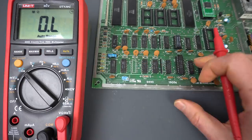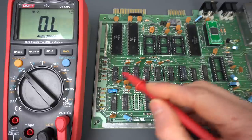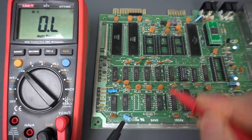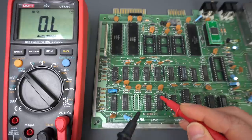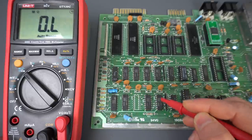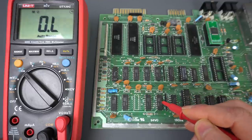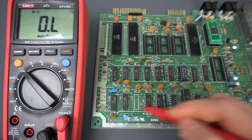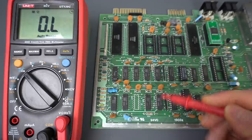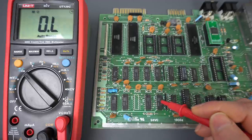I don't know exactly what's going on. I don't know if we pulled out the one weird one and all the other ones are busted. But the RAM is pretty likely that it's bad. So what I'm going to do is remove one other one — in particular this one, because I remember this was one of the data lines that was mostly high, whereas the other ones were mostly low. That way, that will let me know if that was coming from the RAM IC or from somewhere else. And then most likely we'll go ahead and remove all the RAM chips and socket them.